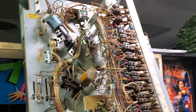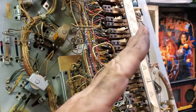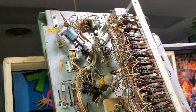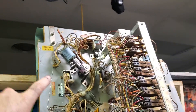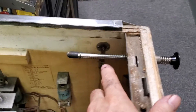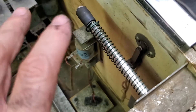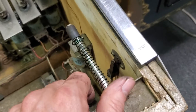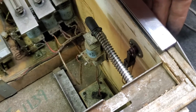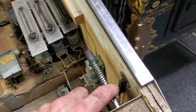Now let's talk about electrical problems. If there's an electrical problem with the flippers, it's going to operate a lot differently — the coil will stick on, or the flipper will go up and then go right back down, or it will work but won't be very powerful. On these old games, the actual power that goes to the flipper runs through the flipper button itself, so you want to make sure those contacts are nice and clean. If it sparks a lot when you're playing, your play style matters too — press the flipper button lightly. If you slap it, it doesn't make good contact and creates vibrations that make the leaf bounce off. Ironically, hitting the button really fast gives you weaker flippers than pressing it smoothly. Clean these contacts because the voltage powering the flipper flows through them; if it's not a good contact, you won't get enough power.